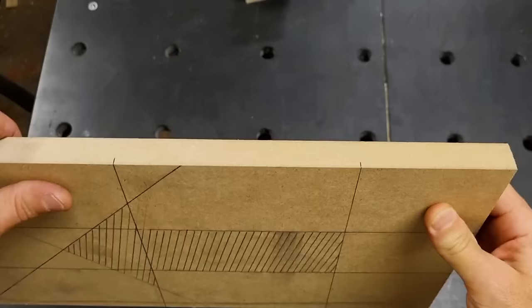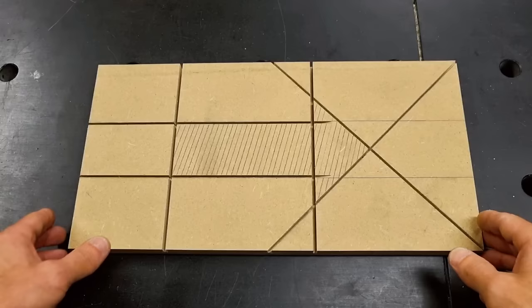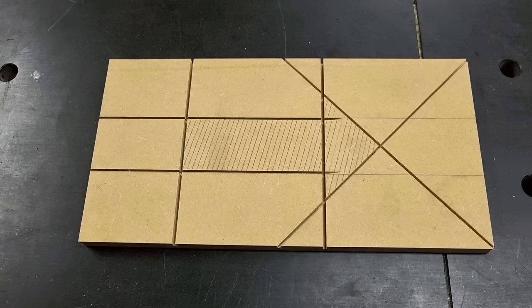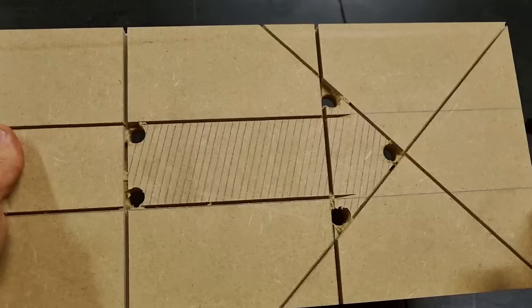Step two is to transfer my layout lines to the cut surfaces of the template piece, and this is of great help if you have this part upside down on the table saw in the next step. Step three is to make these scoring passes — I cut partially through my material and stay inside my lines, using a table saw and sometimes a track saw, or a combination. Depending on the size of the part, you could also use a sliding mitre saw where you can set the depth of the cut.